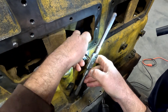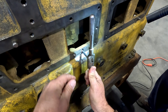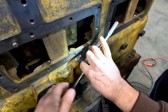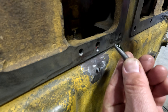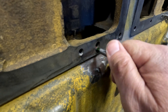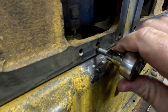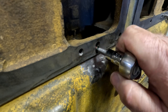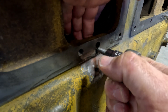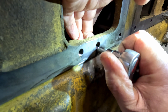That's a lot thicker there — it's twice the thickness of that first hole. I'm about an eighth of an inch or so out on the inside, so we'll stop right there. It's well into that hole. This is actually about perfect — I think I'll file it out by hand until I get the dowel pin to fit nice. I'm about flush, actually. We'll go right there and I'll cut it off.